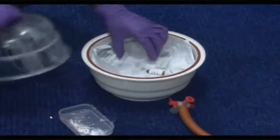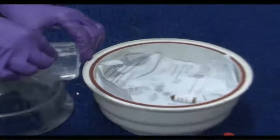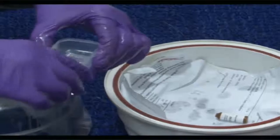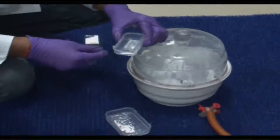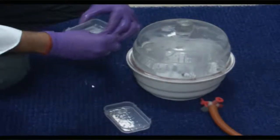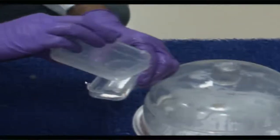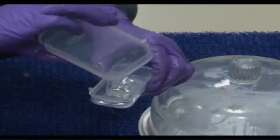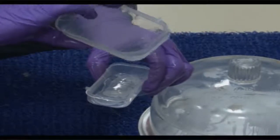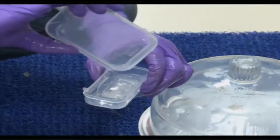So now the mold box is treated and ready. The vapor has all been coated on the surface of this particular mold box as well as the PDMS membrane, which had the ridge like feature, okay. And now you pour the PDMS on the top of this ridge like mold box. This is a premixed resin curing agent matrix. Pour it in a manner so that it covers the entire pattern, okay, and there is a little bit of PDMS remaining on the top, which defines the film thickness that you would eventually need to use on the top of this material.